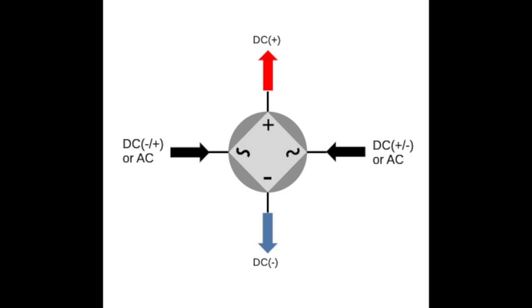So if your train goes in reverse on analog, the lights will still come on. Whereas normally with analog, when you reverse the current, the LED won't light because of the fact that it's a diode. And basically, a bridge rectifier is a series of diodes, if you like, that will only allow current to flow in one direction. So that's a very useful little item. That can also be used for doing your carriage internal lighting as well as a little light on the back, but that's in another video.